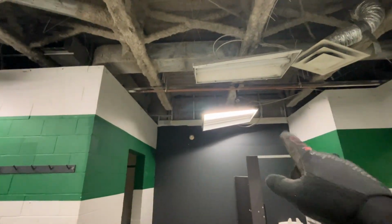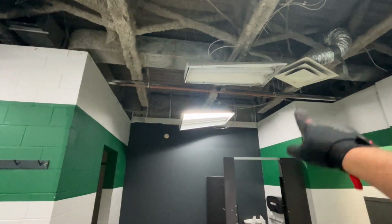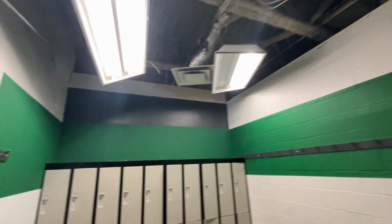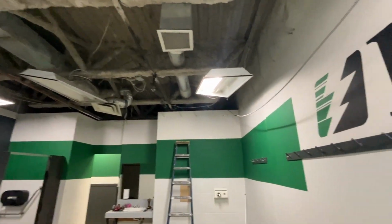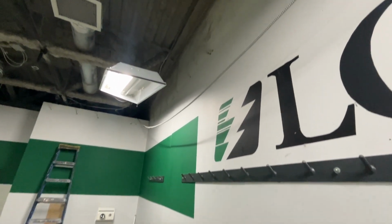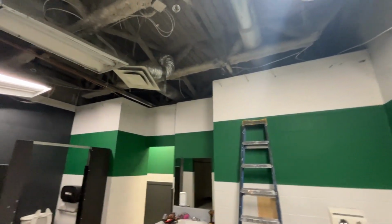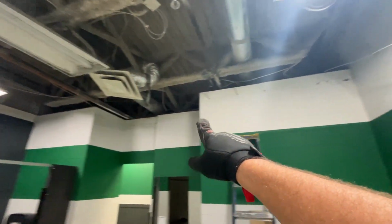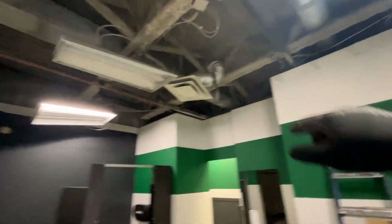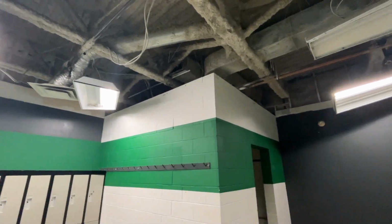That's 5/8 drywall in the areas that are drywalled. Those are easy. I can just extend that up here, extend that up, because it's already drywall on metal stud in these locations. This is a full pour-in-place wall. It was a tilt-up. That already goes up to this ceiling. So really, what I'm looking at is wherever you see this cinder block, I have to build up there to the ceiling. And this piece here, I have to build up as well.